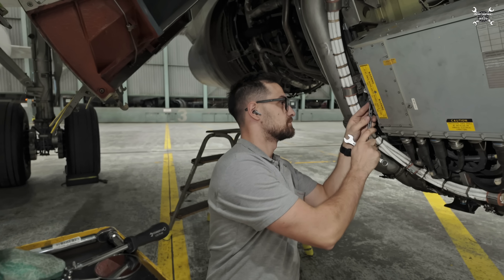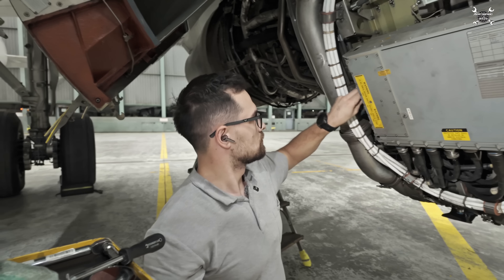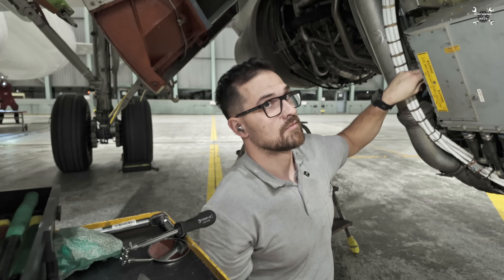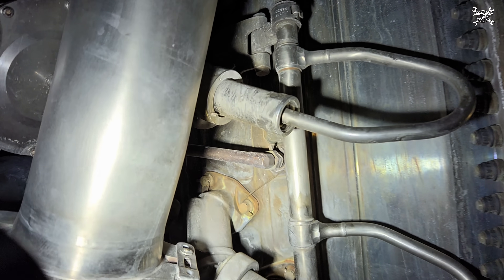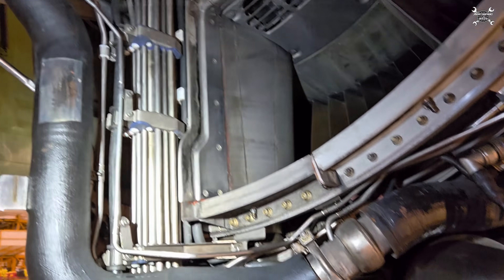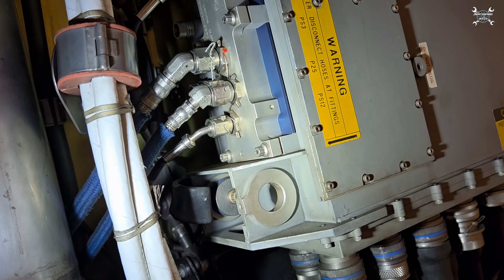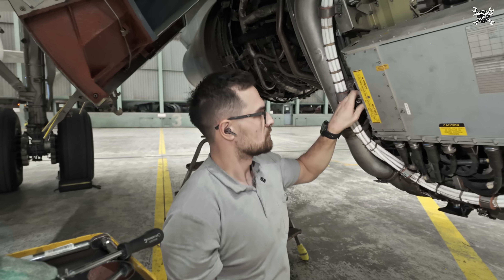Since my colleagues started with the run test on the airplane next to us, I'll try to explain why we need to remove PS3, P25, and muscle pressure from the anti-ice valve. All three lines are responsible for delivering pressure from the core of the engine. PS3 and the anti-ice valve receive pressure from the ninth stage of the high pressure compressor, and P25 receives pressure from downstream of the booster. During wash, a huge amount of water flows through the core of the engine and we want to avoid getting this water into the sensitive electronics of the EEC or the anti-ice valve control section.